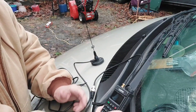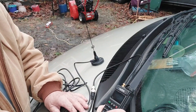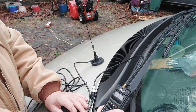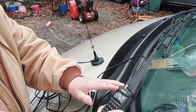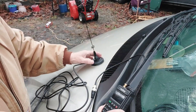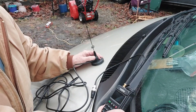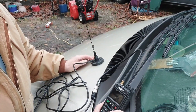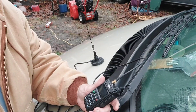Eventually you'd be replacing this with a larger unit in your car that can put out anywhere from 10 to 75 watts depending on how you adjust it. But for now, replacing the rubber duck and using an adapter patch cord so you can use an antenna optimized for two meters and 440 is going to drastically increase the effectiveness of your communications.